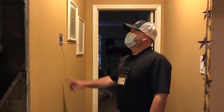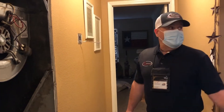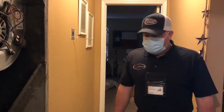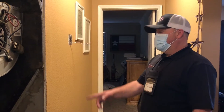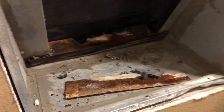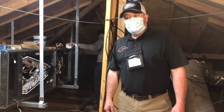For efficiency, I'm also going to change the location of the thermostat — you never really want it right next to your return — so I'm moving it out into the living room. This will look really nice once it's all done, and they won't have so much noise from this unit anymore. The drainage has never been very good on this; it's very rusted at the bottom and has caused a lot of drainage problems in the past, so all that's going to be completely removed.